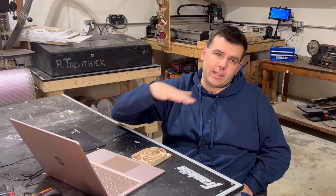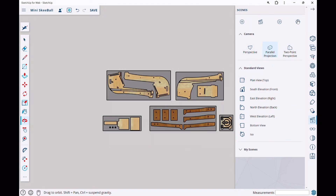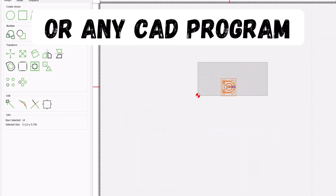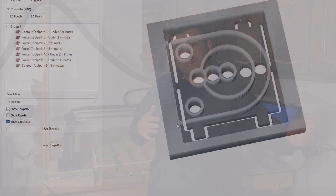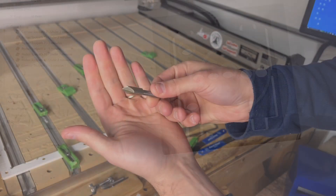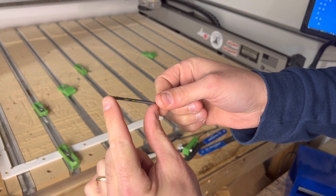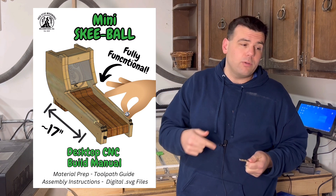With my design finalized and all components laid out, organized by thickness and flat-packed, I can change the view within SketchUp from a perspective view to a parallel projection from the top down so all my parts become two-dimensional objects. Then I export that as a DXF file and import it into Carbide Create to start assigning toolpaths. This whole project only uses pocket toolpaths, contour toolpaths, a few drilling toolpaths, and one V-carve. It only requires a 90-degree V-bit, a quarter-inch down-cut bit, and an eighth-inch down-cut bit — or in this case a compression bit — that is at least able to carve one inch in depth. If you want to make this yourself, I have an extremely detailed build manual linked down below right below the subscribe button.